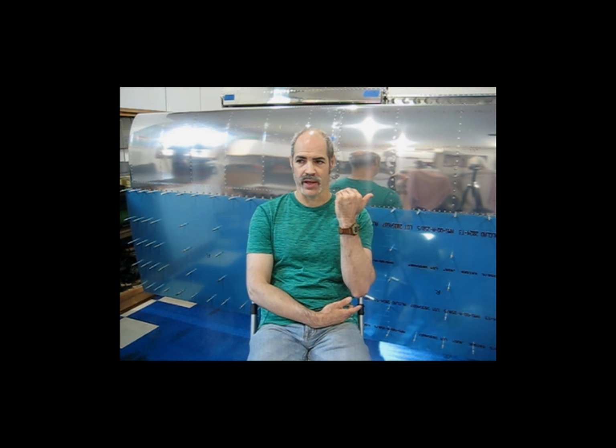In between them, I use this as my backing plate. This is a large, very heavy, half-inch thick piece of stainless steel. On the back side of it, I just padded it a little bit with some duct tape so that it doesn't scratch my floor too bad. And then on the front side, I just put some blue painter's tape to keep it from marring the skins. So I just set this up on the floor. And, you know, of course, I can position these wherever I need them. Lay my skin across and back rivet onto the plate, over the plate here.